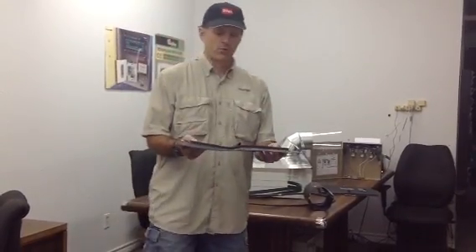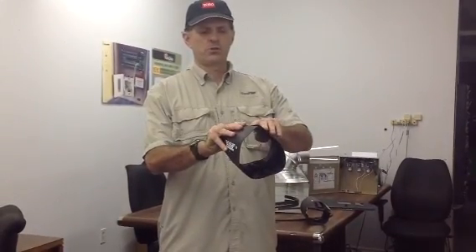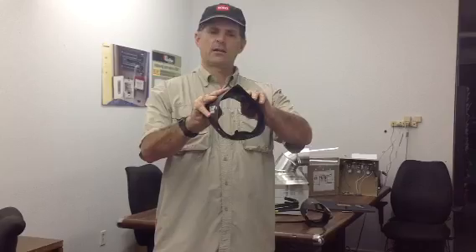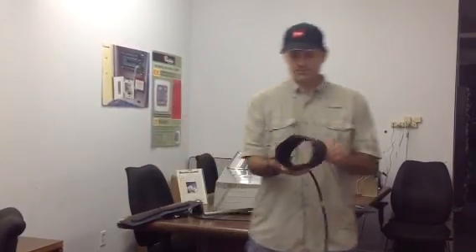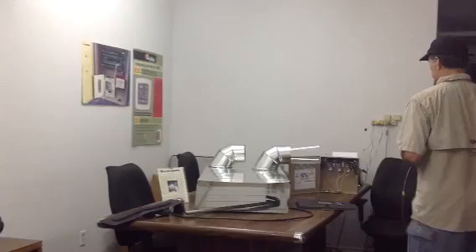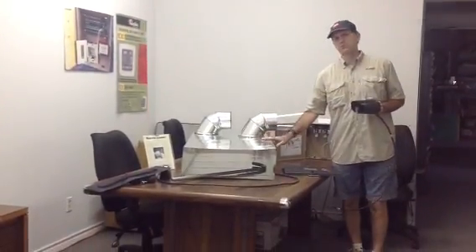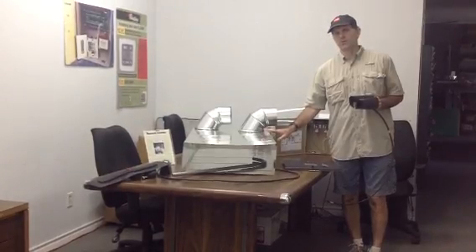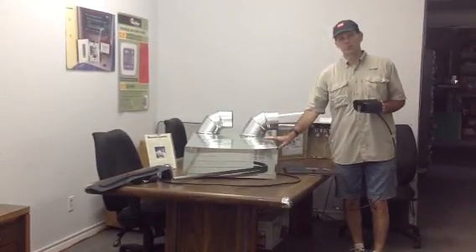This is a round flex damper. This is the way you get it. When you get it, you size it and then you put the two ends together with a special heat-activated tape. That gets you this — this one's ready for installation. This application we're demonstrating is specifically for basement applications where the duct system has been covered with sheetrock.